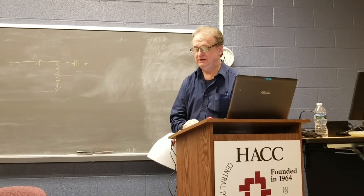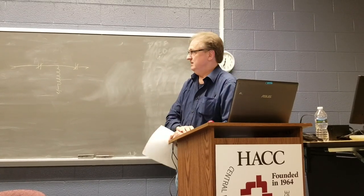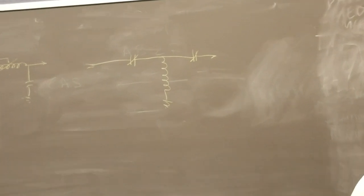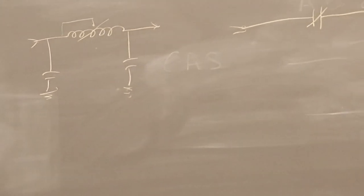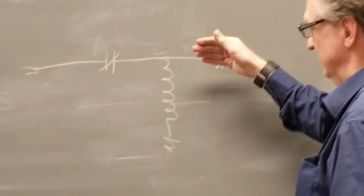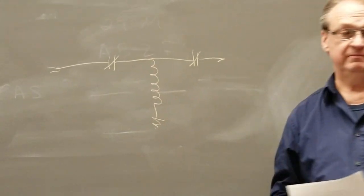Now, the other thing: where does that power go if it's not being delivered to the antenna, and it's in the antenna tuner? What's happening to this poor little antenna tuner? You might have one that's rated at 150 watts, and you're pumping 100 watts into it, and you've got a signal coming back into it that's being absorbed and handled in that tuner.